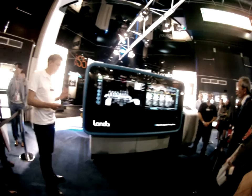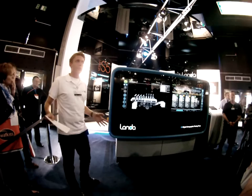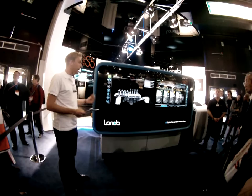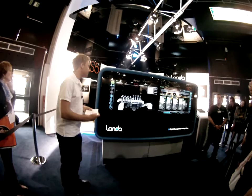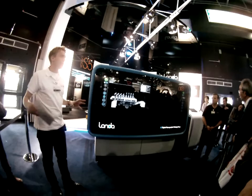The combination of a familiar offset platform, built-in diagnostic and recovery tools, and comprehensive remote support will increase press uptime, critical for commercial printers. As you can see on the left side of the screen, we have a 3D cross-section of the press. It displays live status feeds. The indicators provide short messages to the operator that you can easily understand and respond to. For example, the highlight you see now indicates there's a blanket conveyor issue. If you press on troubleshooting, another window opens up with detailed information about how to resolve the problem.